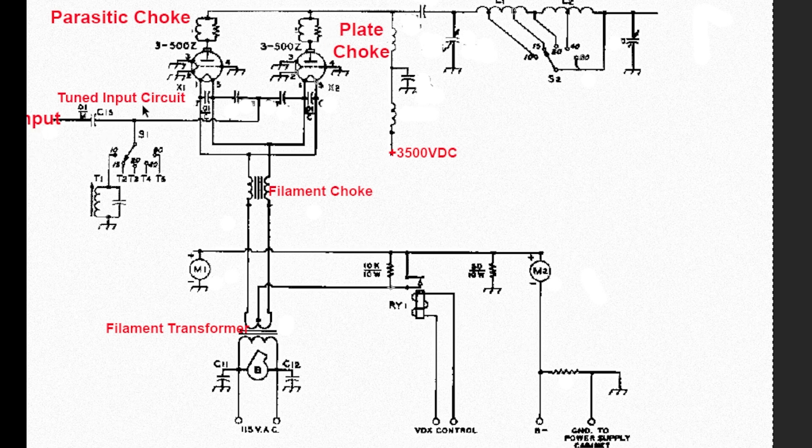So you've got the input tuned circuit going into the tubes. This prevents the RF from going towards the filament transformer. The tubes provide amplification because we've got virtually zero volts at the bottom, but the top of the tube — where that plate cap is — has a lot of voltage on it, so those electrons get going towards that plate. This is grounded grid: the grid of the two tubes is at ground. The RF flows out of the top of the tubes, protected from going into the power supply through the plate choke.